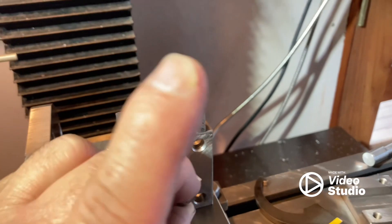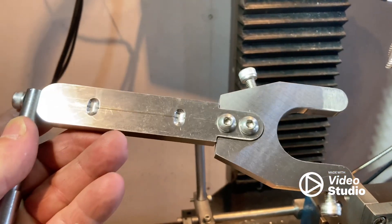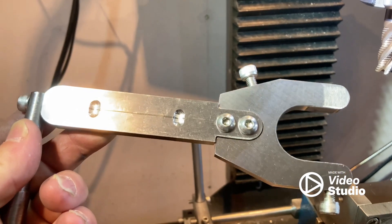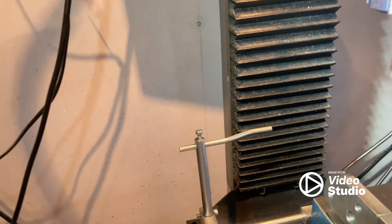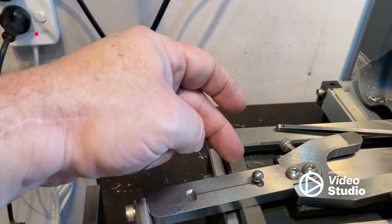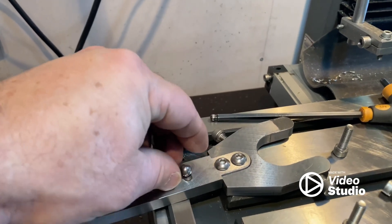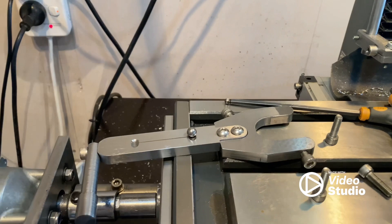The spring sits in and then there's a ball bearing that sits there, and that's what holds the spanner in place. There's the spanner - I made the spanner in two pieces because I was too lazy to cut that whole shape out, but it turned out to be more work making it in two pieces anyway. So it didn't need to be in two pieces, but it is. Those two little machined-out areas are for the ball bearing - it holds it in the disengaged position, and when you slide the spanner it'll be in the engaged position. When it's disengaged, you don't want vibrations causing the spanner to creep in towards the spindle, and that works really well.